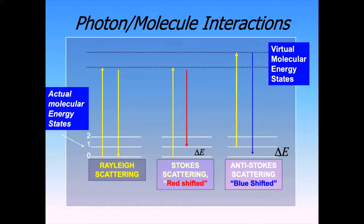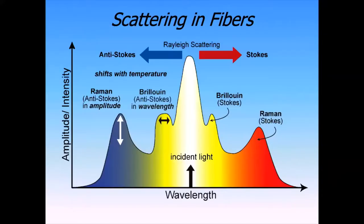What we're interested in is measuring these Stokes and anti-Stokes photons coming back to our detector. The warmer the glass is, the higher the energy level, and I'm going to have the potential to produce more anti-Stokes photons as it warms up. So essentially, the number of anti-Stokes photons I get back is a function of the temperature of the scattering site. Here's a schematic of those wavelengths and amplitudes. Our incident laser light for DTS is typically in the near infrared — around 1000 nanometers or 1300 nanometers, which is also a common wavelength for data communication on optical fibers.